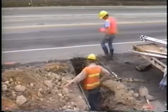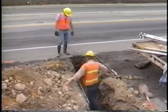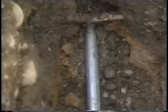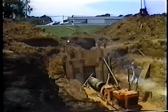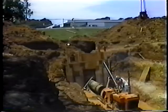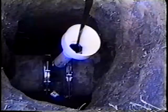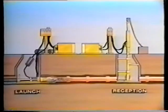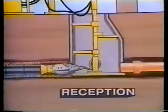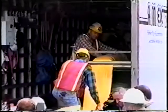New technologies and advances in existing ones promise to improve trenching operations or, in many cases, replace them altogether. For example, jacking and boring are trenchless methods of installing pipes beneath roadways. They have been in use for some time, but continue to be improved. Live insertion, small hole vacuum excavation technology, service terminations utilizing specially designed extension tools, pipe lining, and pipe bursting are newer procedures for rehabilitating or replacing existing pipes. Such technologies should be considered as alternatives to conventional trenching when costs and other factors permit.